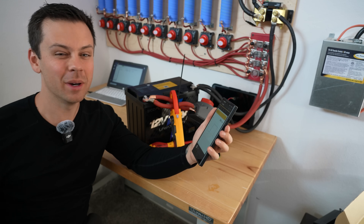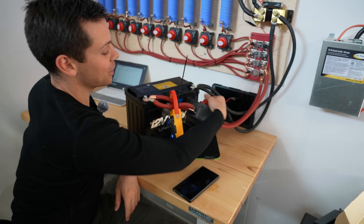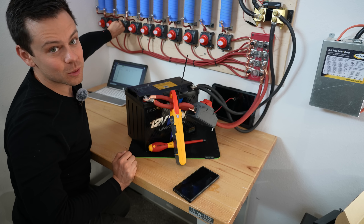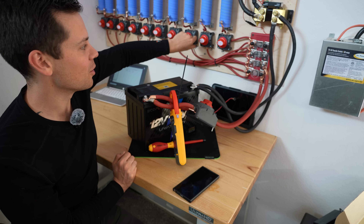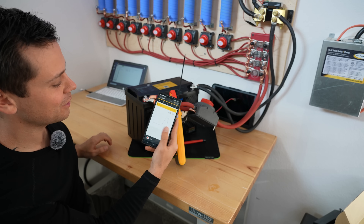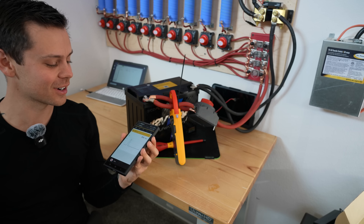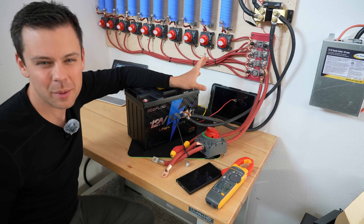It does have a good surge capacity, but it does not reset as fast as the other trolling motor batteries — it takes about a minute. Now for the final test, we're going to do a dead short: 600 amps across these terminals. We're going to turn on all of these, and it should disconnect very quickly. If it doesn't, the overcurrent protection doesn't work. Press record and turn it on. 470 amps — it disconnected in less than a second. It works exactly how it's supposed to, and that's fantastic.